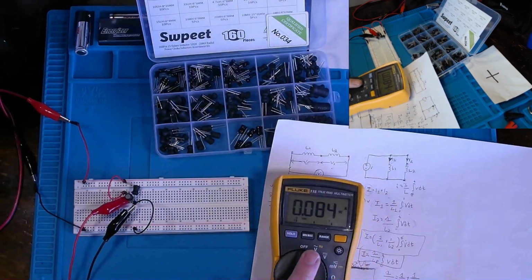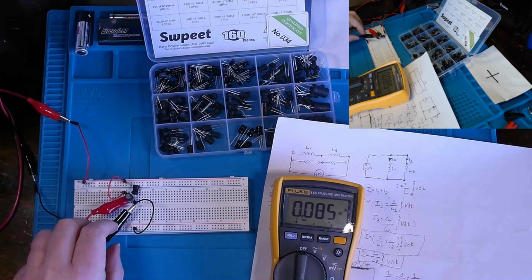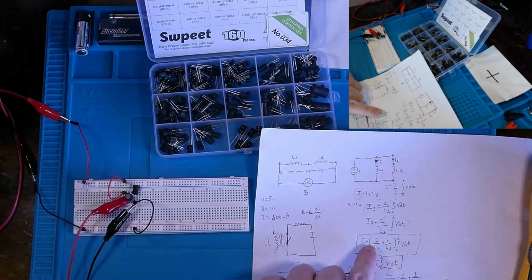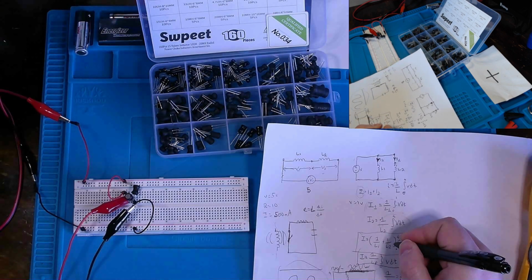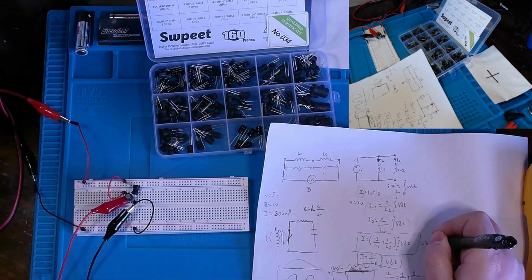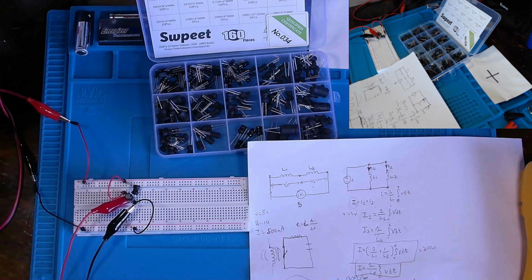So is there something else at play here because they're inductors and not resistors? And the answer is essentially yes. Let's go back to our formula here. If I were to insert L1, which is 10 millihenries, and L2, which is 10 millihenries, 1 divided by 10, so we're looking at 0.1, 0.2. So we're essentially coming out to 200 milliamps from our power supply, which is reading a little bit low.